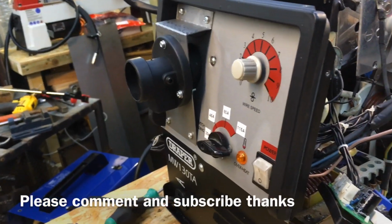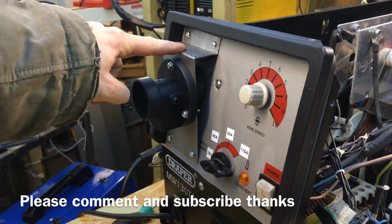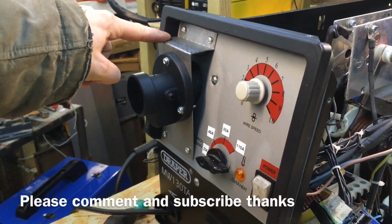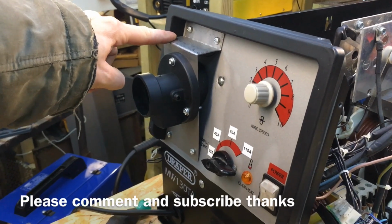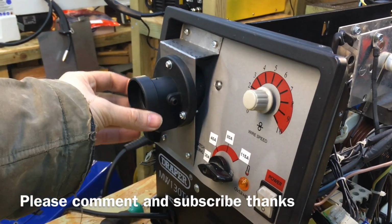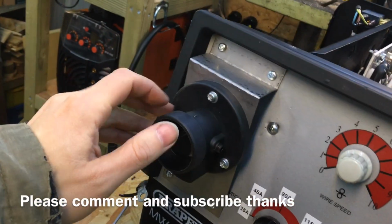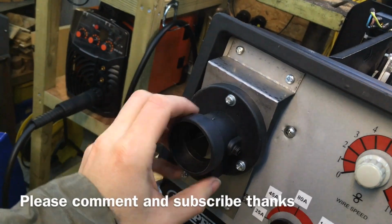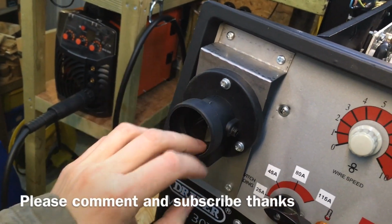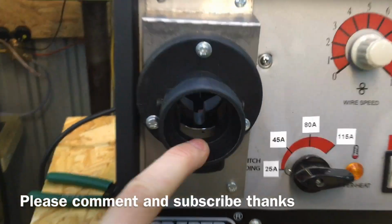Right, so this is where I've got to so far. Here's the metal plate that I made. I just bent this in the vise and drilled a hole through it so the Euro torch can go through. I've mounted the Euro torch mount on here. The screw holes I elongated a bit, so that means there's a slight amount of adjustment in there, so when I put the Euro torch connection in I'll be able to line it up with the feeder properly.